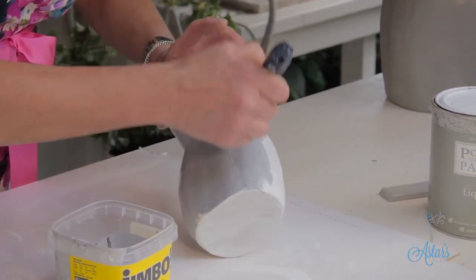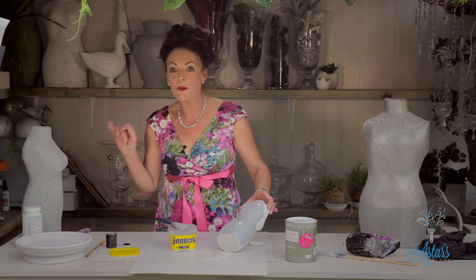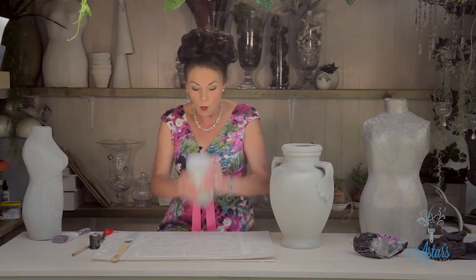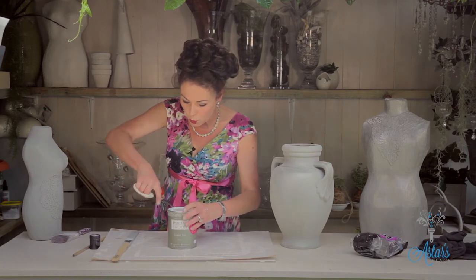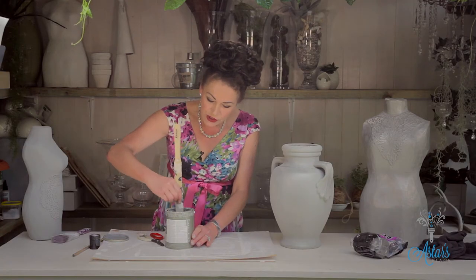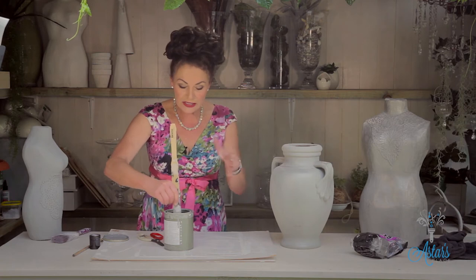Then that just gets layered over the surface. Now you're going to let that dry — it goes quick. There's your undercoat. Once that's dried, we go on to the next process, which is applying the tin paint. A little word of warning: because this has got an immense amount of tin particles in it, you need to give it a really, really good shake to make sure those particles are all evenly mixed through. Then after opening it, get right to the bottom of that tin and give it another good stir — about three to four minutes to make sure those particles have all been evenly dispersed. A good idea is to keep your paddle in there so that when you are applying your paint, you continue stirring.